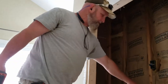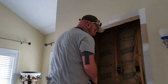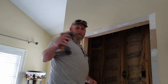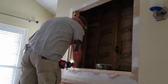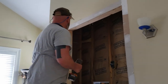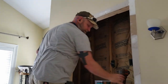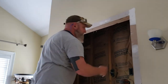Now this drywall - your standard drywall in houses is half-inch drywall; garages are usually five-eighths. It has to do with a fire rating and has to do with carbon monoxide or dioxide for going from your garage into your house. So I'm just leaving this out the same distance as the drywall that's there. These side pieces are not something I actually have to put in here; I need to put these in just for strength.